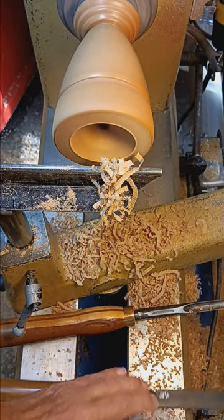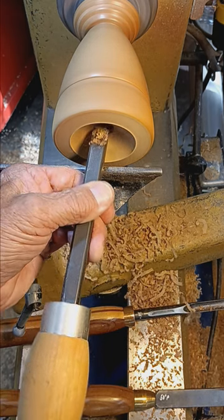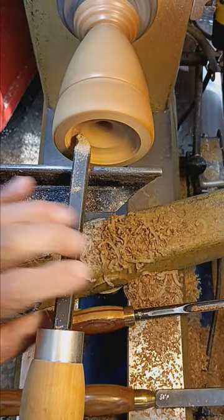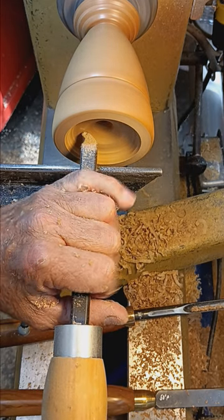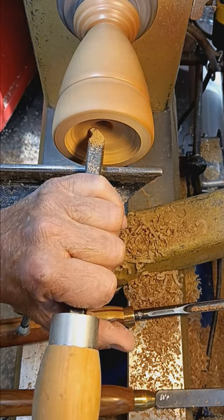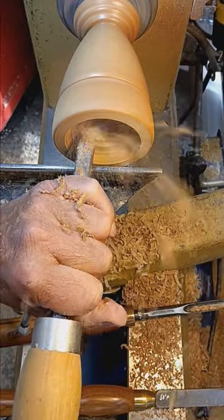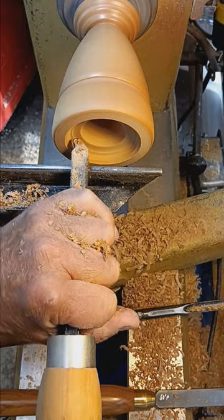The other tool I like to use is this Hunter Viceroy. I think it's actually a lot easier — first of all, it's a smaller cutter. The advantage of the Viceroy tool over the flat scrapers is that the tool is cutting, so the tool doesn't dull. When you're scraping and you're rubbing that wood across that outer edge, it dulls that edge really quickly. Because this is actually cutting, it's not doing that. And you see, I can push straight in. It goes very quickly with that tool. I like it a lot.